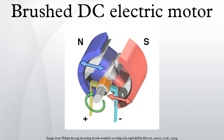This current can make an excessive voltage drop affecting other equipment in the circuit and even trip overload protective devices. Therefore the need arises for an additional resistance in series with the armature to limit the current until the motor rotation can build up the counter-EMF. As the motor rotation builds up, the resistance is gradually cut out.